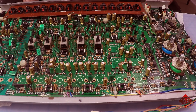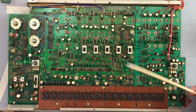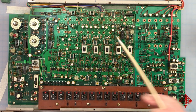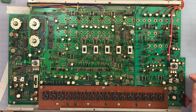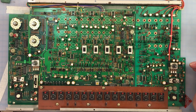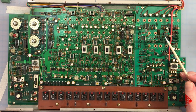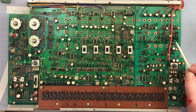There are a couple of things I wanted to share in hindsight in relation to working on these boards. The boards are different in more than one regard — not just in appearance, but in the way they're manufactured. The main board is a double-sided printed circuit board, whereas the so-called voice board is a single-sided circuit board, and they have different considerations when replacing capacitors. With respect to the single-sided board, you have to be aware of the fact that there's very little holding the traces onto the board, so there's tremendous potential to pull a trace off when removing the old capacitors.